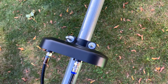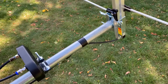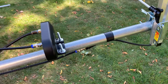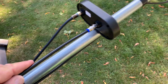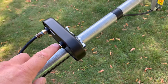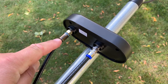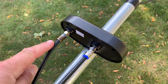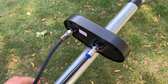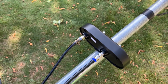This is the part of the preamp that gets mounted outside — it gets bolted to your TV antenna mast. The connections are pretty simple: you have a coax cable that comes out of your TV antenna, which loops into the input side of the preamp. On the output side is a cable that runs back into the building to your TV or digital converter box's RF input. This cable, besides carrying the TV signal in, also has the job of bringing that DC voltage back out to power the preamp.